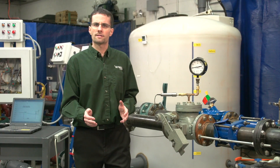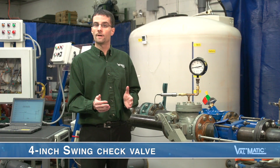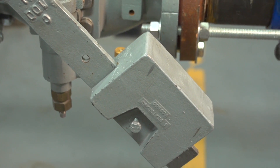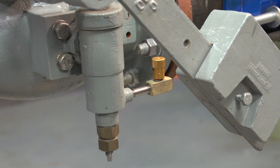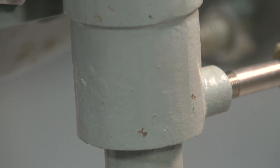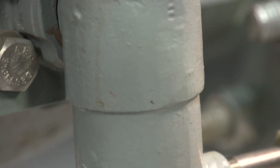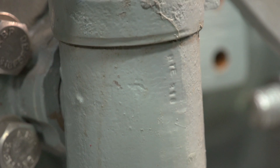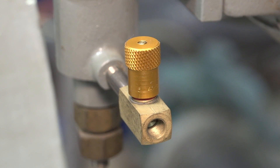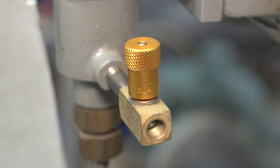The first valve we're going to test is a 4-inch swing check valve equipped with external lever weight and air cushion. A conventional air cushion is designed to draw free air into the bottom of the cylinder and vent air out of the top of the cylinder as the valve opens. Then when the valve closes, the release of the compressed air in the lower cylinder is controlled using a flow control valve on the bottom cylinder port.